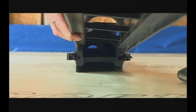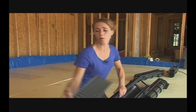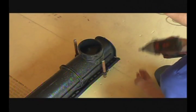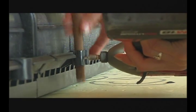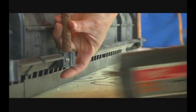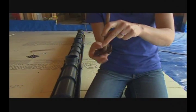These are recycled polypropylene, so they're going to be strong and durable. Eventually we'll be putting in some decorative grates, but for the concrete pour we're putting in temporary grates to help protect them. You want the concrete to support the drain on both sides and on the bottom, so the drain has to be supported at the proper height. We're using rebar, fastening them to the sides of the form with some screws. Rebar can get sharp after you cut it, so we're protecting our waterproofing by using a little bit of dimple wall right underneath — that keeps everything safe.